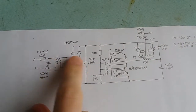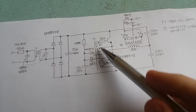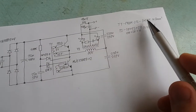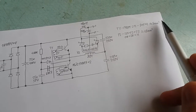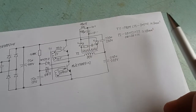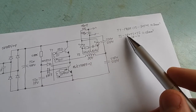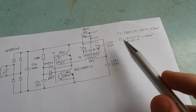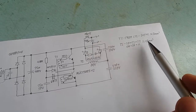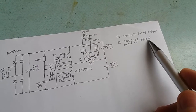So here's the schematic — again, very simple, nothing really to write stories about. The feedback transformer is a core from a CFL; mine was about 9 by 5 by 4 millimeters — that is outer diameter by inner diameter by height — which gives about 8 square millimeters of cross section. The power transformer is a toroid as well, with dimensions of 20 by 12 by 12 millimeters, giving 48 square millimeters of cross section. It's not necessary to use a toroid — you can use another core, but make sure it is made of ferrite, not powdered iron, and that it has a similar cross section.